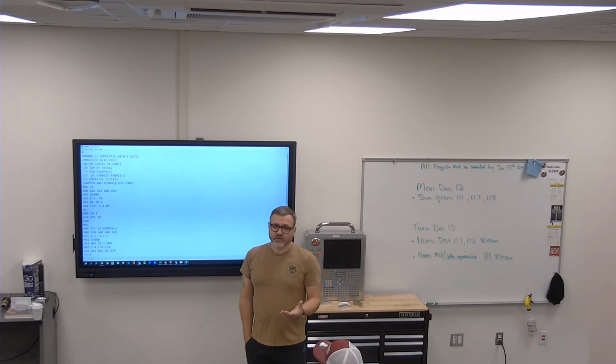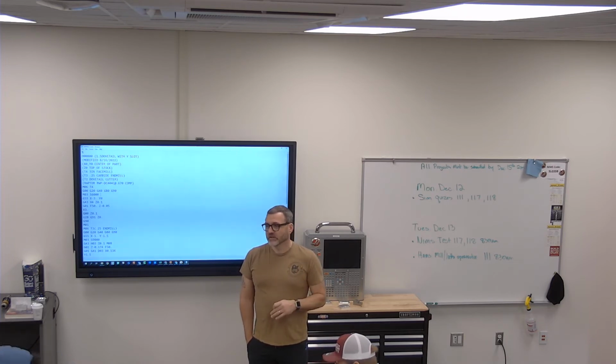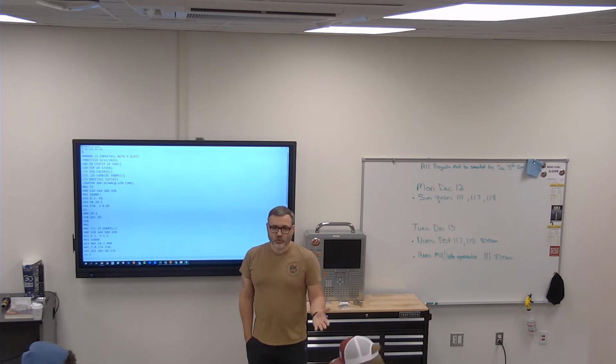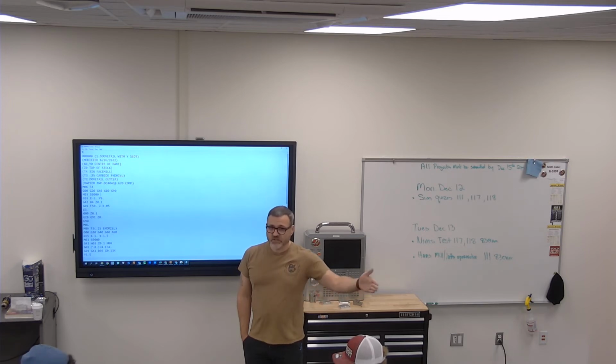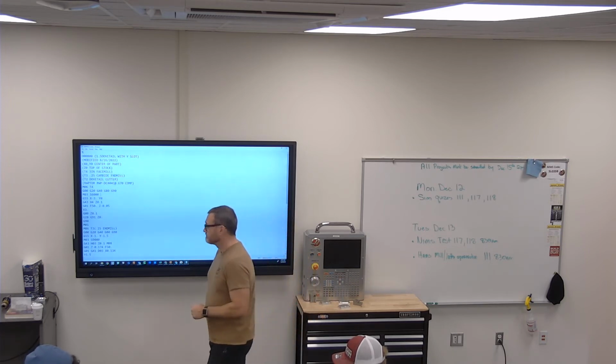So let's just say you're doing a grid program, and all your company does is make tables that have a whole bunch of tapped holes in them. You make one program where all the holes are 1 inch apart from each other, and another where all holes are 1.25 inches from each other. When you make your second program, if you're going in absolute, you've got to change all those numbers. If you're in incremental, you change one number and you say, go 1.25 inches. Does it keep changing? Because it always goes from its destination and picks up its next home point, I guess, right?